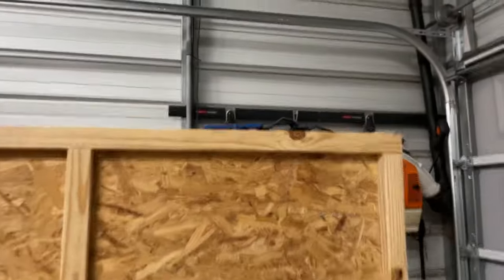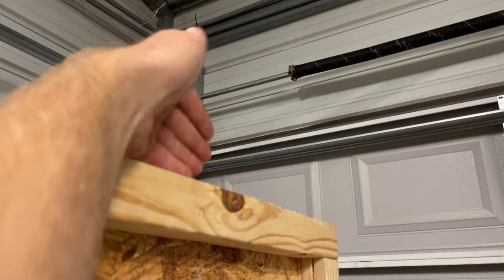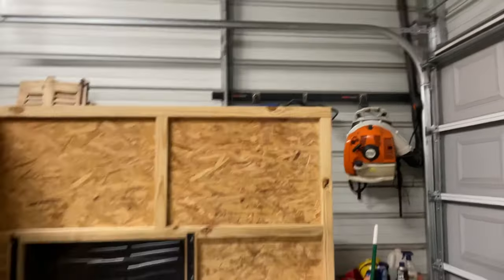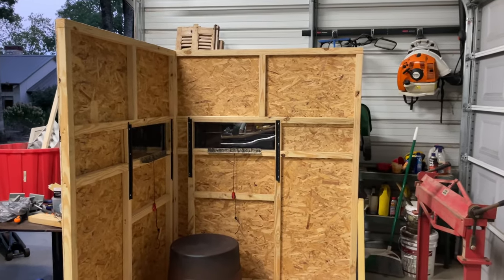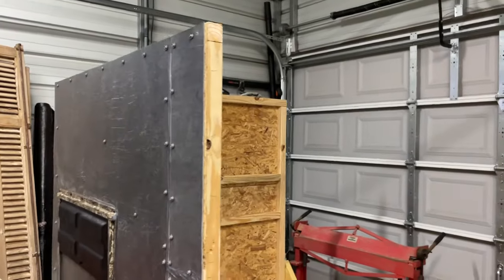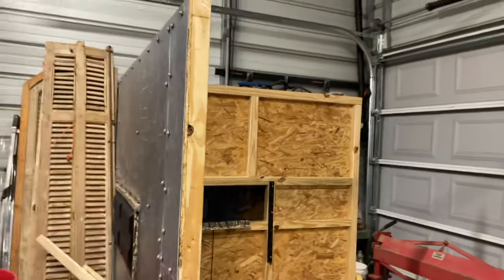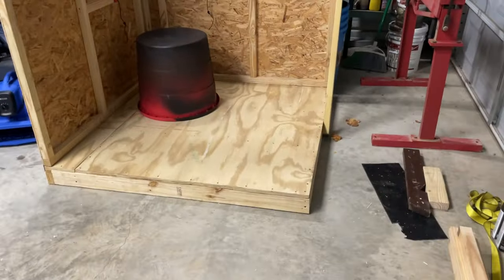The easiest way I've found to do the roof - since I have an overhang anyway - is I make it with two-by-fours on top of the one-by, so I can screw from underneath and suck the roof down. The natural lean is built into the actual roof itself. I don't have to do any outside screwing. The only thing I do on the outside is caulking before hanging, and I bend some small metal pieces for the corners and screw those on for extra protection.